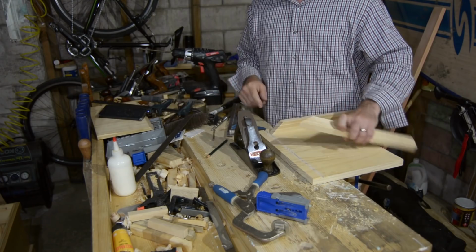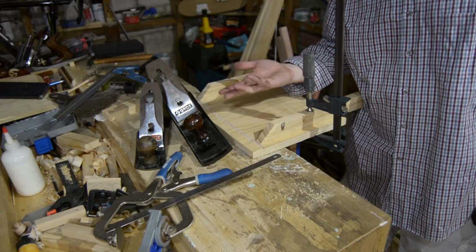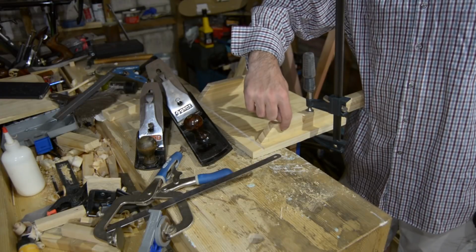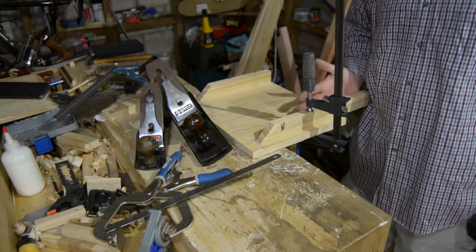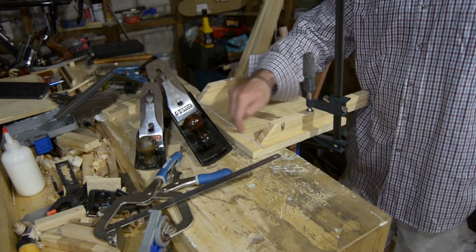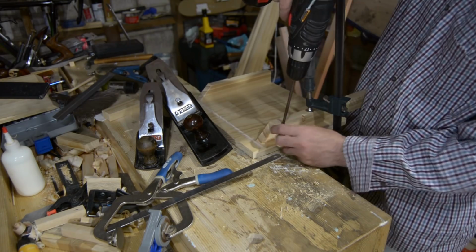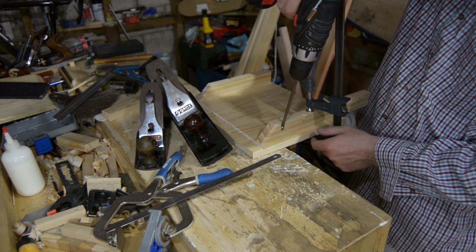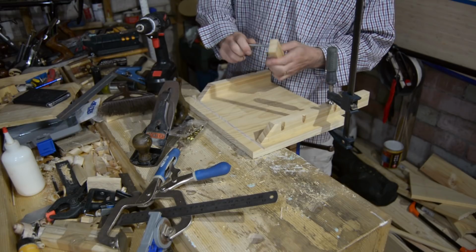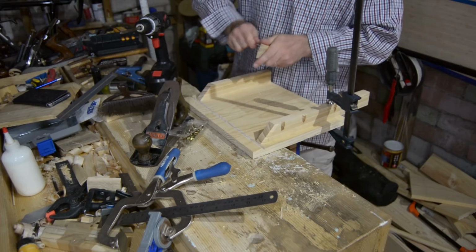Okay, so there's that side. 10 inches between this and this, so I can get a 10-inch board in here, which is 9.5 inches. I'm just putting in one screw on this up in the front. That way, we can make this square with this groove first before we put down these other ones. But this is my fulcrum, my pivot point. This is a M6 bolt, and it's a bit long, yes, but it's going to be what helps us adjust this.